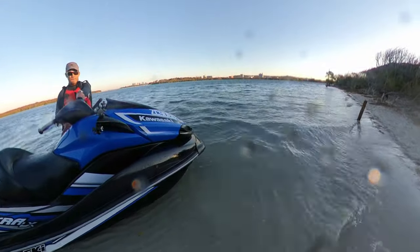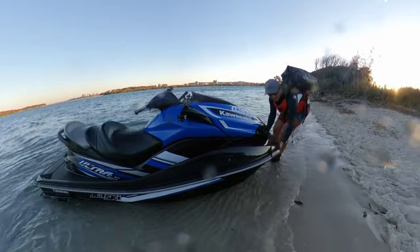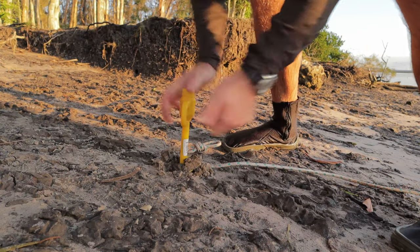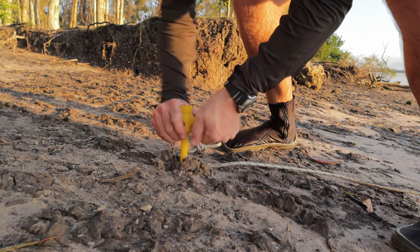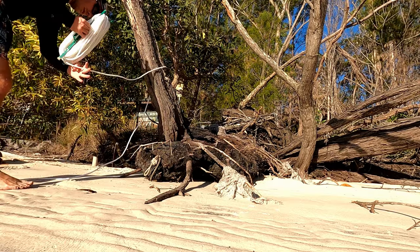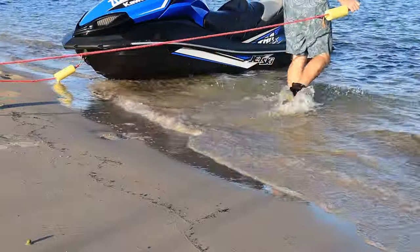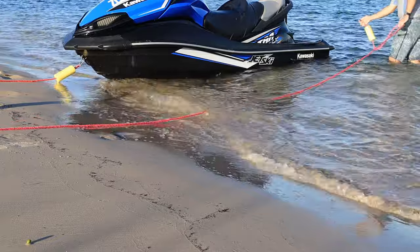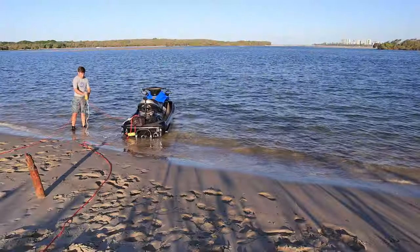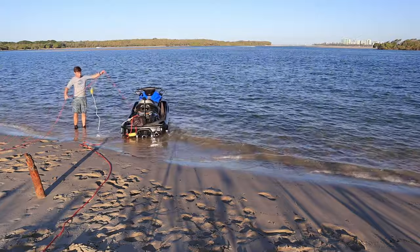When you arrive at your anchorage, briefly motor into shore and find a sturdy and reliable tie-off point along the beach — let's assume it's a tree, as this is what I generally use. But if there's none around, you could use a post, a screw-in sand peg, or even a second anchor. Run the loop rope around the back of the tree so the loop rope encircles the tree. Clip one end of the loop rope to the bow of your vessel and the other end to the stern. Now clip the anchor rope snap hook onto the loop rope towards the bow end, and ensure the anchor rope snap hook can slide freely along the loop rope.